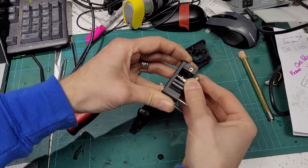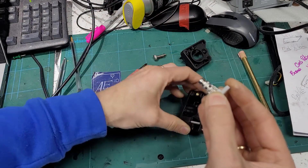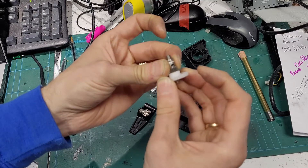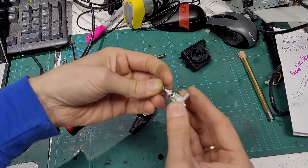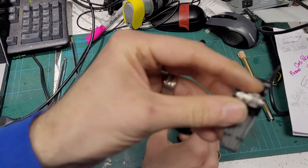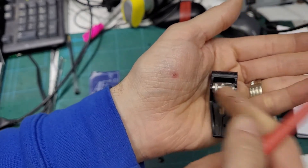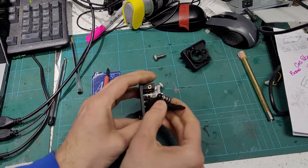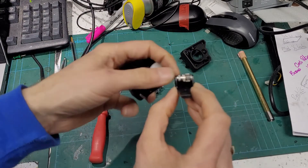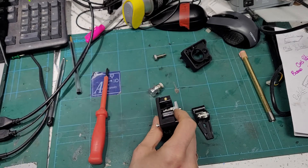Just before we do that, a few things to note with these extruders. One: gear alignment is sometimes off, so when it's assembled at the factory it's not always in line with the hole - that can make feeding hard or even loading the filament hard. Two: check it's not loose on the shaft. Three: I'm going to put two washers in there just to make sure it's spaced over so that when it closes, the wheel lines up with the hole properly. Once you do that they feed brilliantly - except for flex - and this mod makes it feed flex really well too.